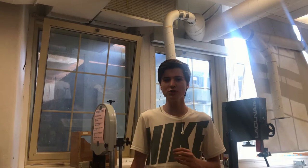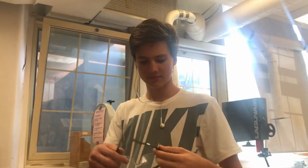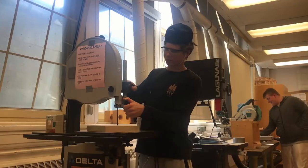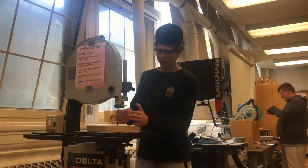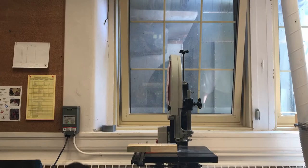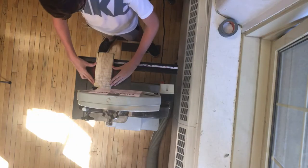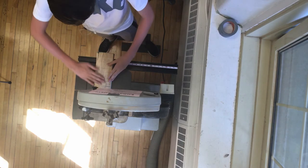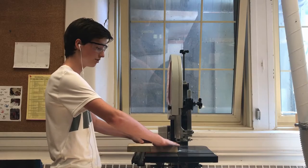When using any form of equipment, the most important thing is, of course, safety goggles. Adjust the upper blade guard so that the blade is always covered. An exposed blade is always dangerous. Always keep your hands away from the line of cut. Never put your hand directly into the path of the saw.